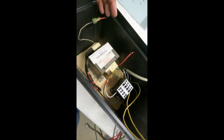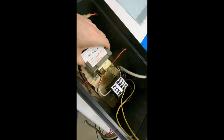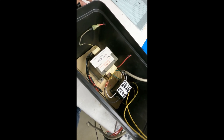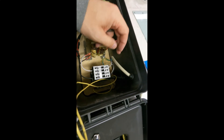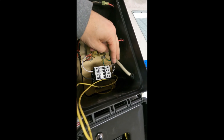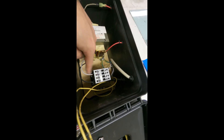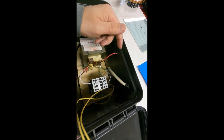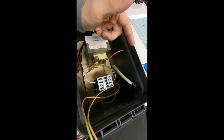When I carry this around, the weight of it keeps it down on the bottom. I'm not going to tip it over too much, so I really don't need to strap it down. This is going to work out good, especially for how often I'm going to use this. Also worth noting is that I have two AC inputs. The AC that goes to the transformer is going to go through the relay, but it's separate because I want to use a variac on it that has an internal fuse and I can have more control over that.